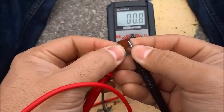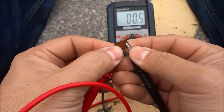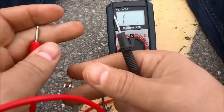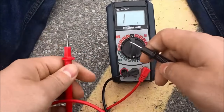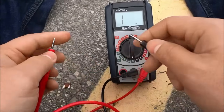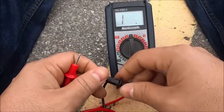As you can see I am touching both terminals to both ends and I am getting 0.6, 0.5 — it is close to zero, and that means there is continuity in this car fuse. And that is basically it. You can use the terminals to test a wide variety of items, wires and objects. The only thing I recommend is to be careful with what you are testing. In this video I have shown you how to test for continuity, and that is all I have for you today.